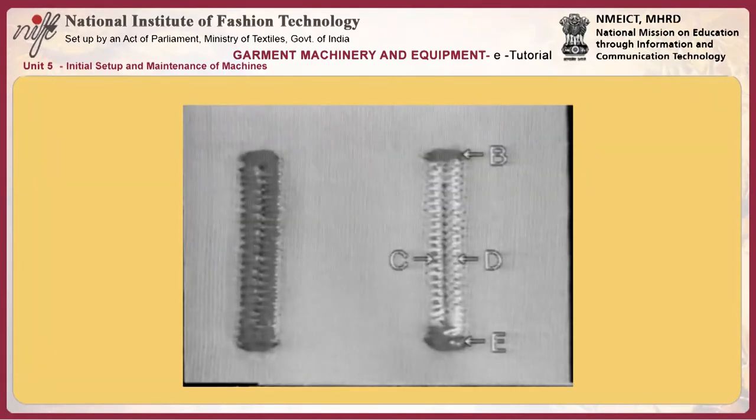Adjusting stitch formation. 15.1. Configuration. As observed from sewing start position A, section B is called first bar taking section, C is called left side parallel section, D is called right side parallel section, and E is called second bar taking section. This machine is able to perform buttonholing with two different kinds of seams, such as purl stitches F and whip stitches G.